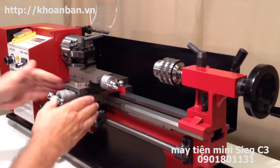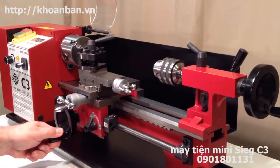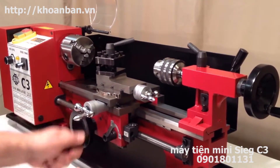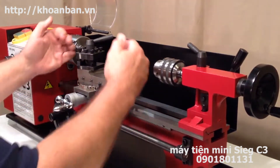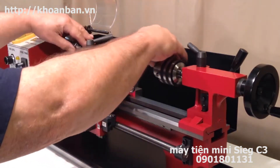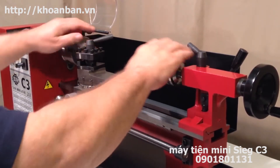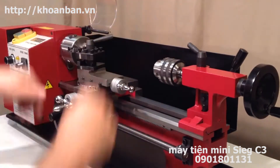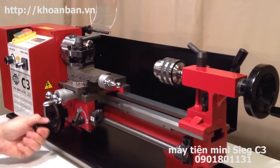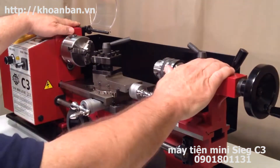The carriage, which I'm moving here, is called the carriage and it moves along the ways. The ways are set up so that they're parallel with an imaginary line running between the headstock and the tailstock, and that imaginary line is called the lathe center line. So we move the carriage along the ways between the headstock and the tailstock.